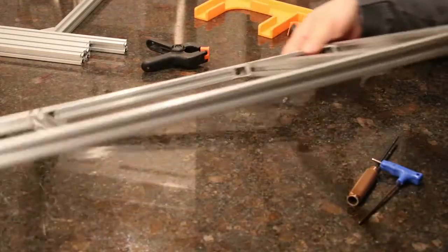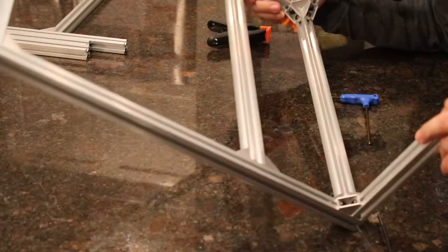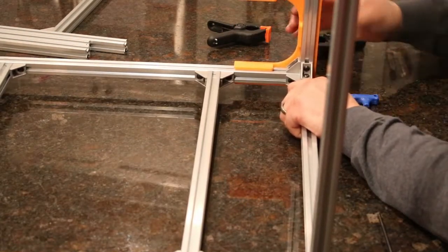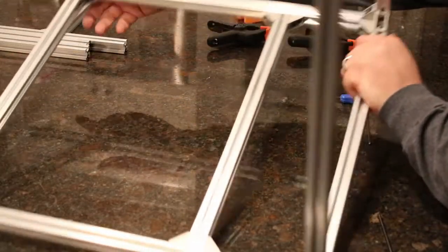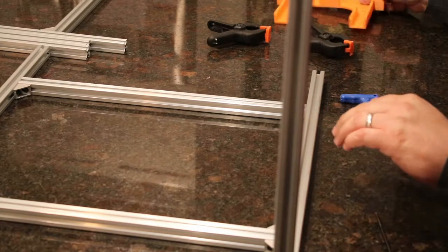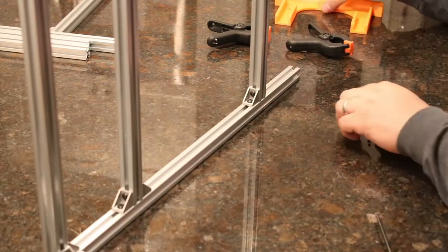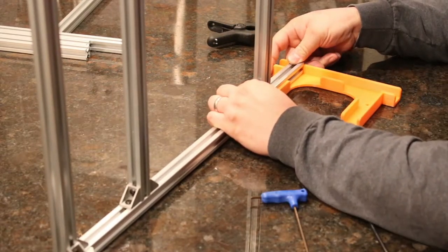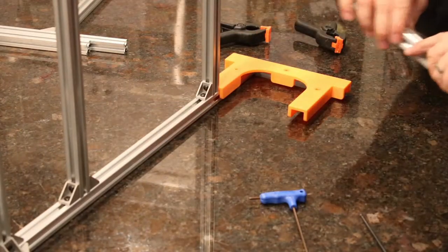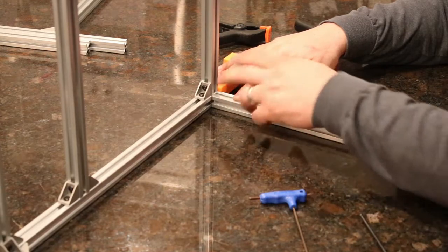We've got one corner done. Rotate around to the other side and repeat the same process. Check visually that the nuts are square and in place — they're looking good. Remove the clamp and move to the other side of the printer. Place the vertical pieces from here. Turn the printer on its side and assemble them just like we did for the sides, pushing this tool into the top, taking a 2020 extrusion and placing it against the tool to ensure it's aligned — perfectly aligned with the other piece because we used the same tool.